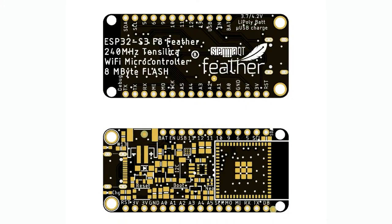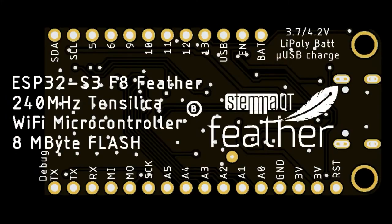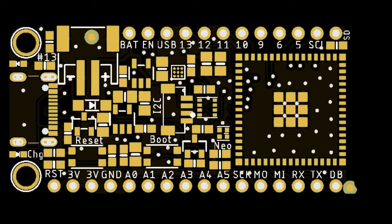And then you're also working on? I did a slight tweak to the ESP32 S2 Feather for the ESP32 S3 F8 Feather — the S3 Mini Module. I got a couple of samples from DigiKey before they ran out, and it's pin compatible. There's one little mini change, which honestly just meant a pin was disconnected instead of connected to ground. I also changed how the pull-ups for I2C work a little bit to make it a little bit lower power.